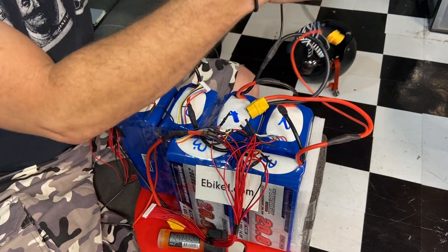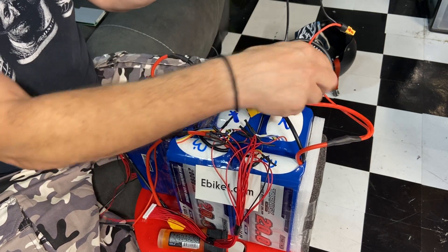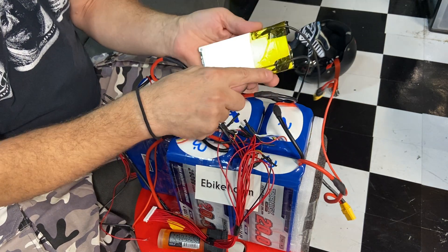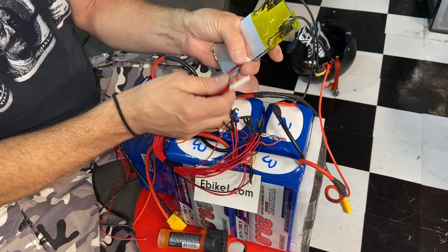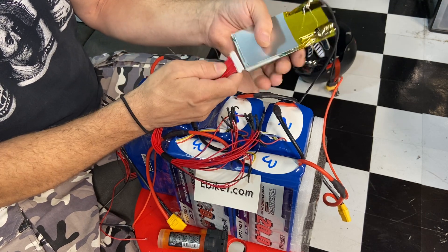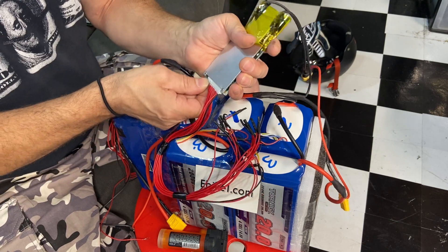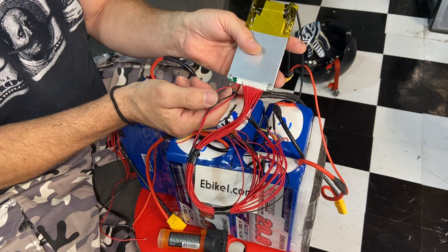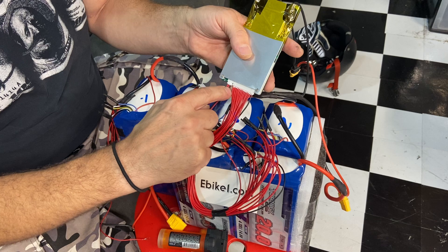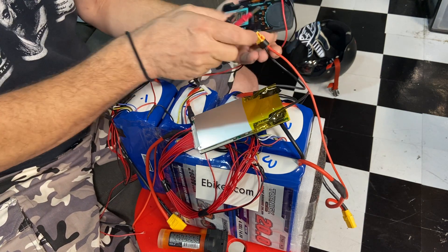Once you do that, go right to the end. The BMS gets wired — this is B, it's under the tape, but this is B. So you go from number 1 brick; it goes to your controller, goes to the BMS, and then C goes out and goes to your charger. When you plug this in you have to do it in order — do this step last. If any of these numbers are wrong, it will smoke up and you'll burn out your BMS. Anytime you do work on your battery you always want to unplug these leads. I left the last wire off because it has 18 wires and you only need 17 for a 16S BMS — the black one is 0 and you count up to 16.